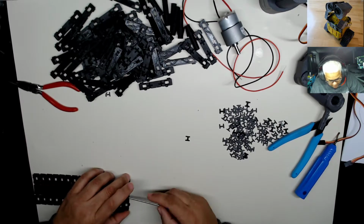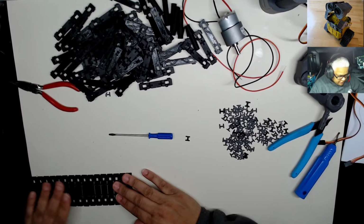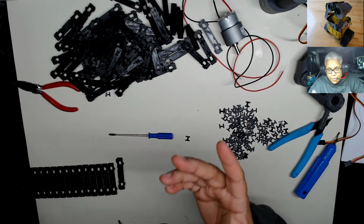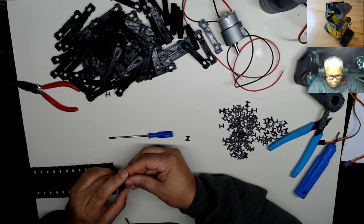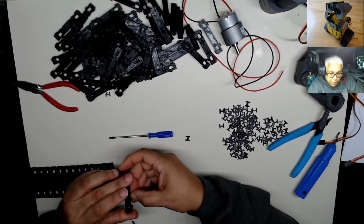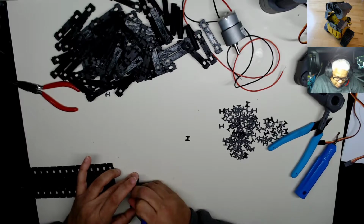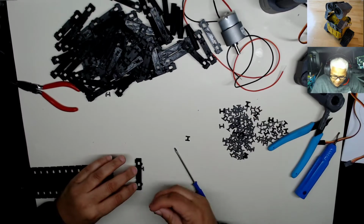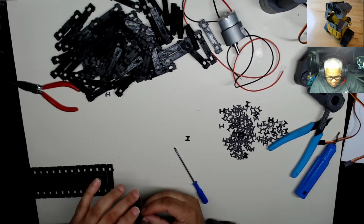Also, I had issues with the neck. Some of the parts did not have a lot of tolerance included in the making of the part. For some printers, if you put in an inch, you may not print out an inch. It's in millimeters, so if you draw 10 millimeters, it may print out as 12, or greater. So you have to allow for that.